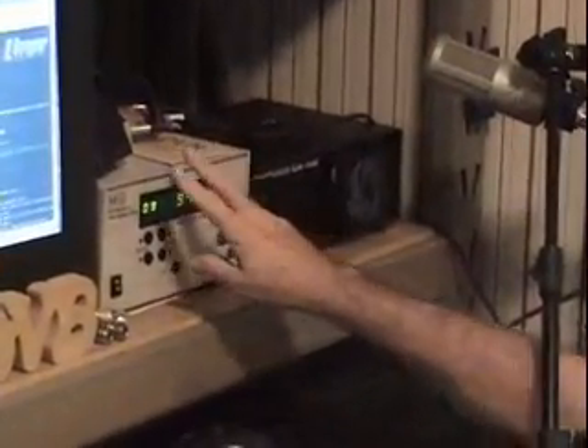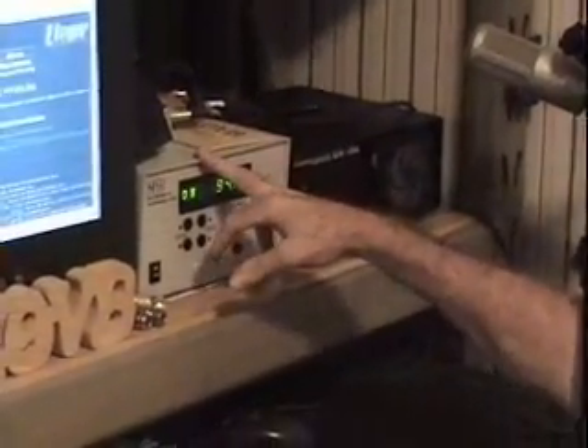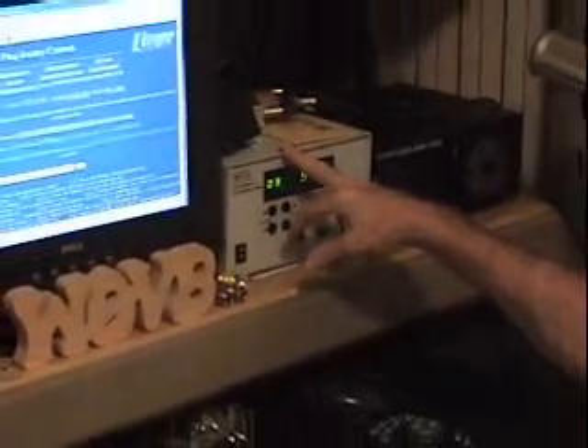This station is set up with one computer and three monitors. This is the main radio over here, which is a software-defined radio made by Flex Radio, Model SDR-1000. When we go outside, you'll see a windmill tower with some antennas on it. I have a two-meter beam — a single beam up there that's eight wavelengths long, which is 55 feet. This is the controller for that.